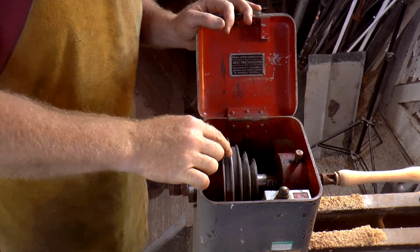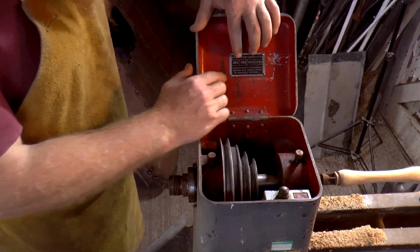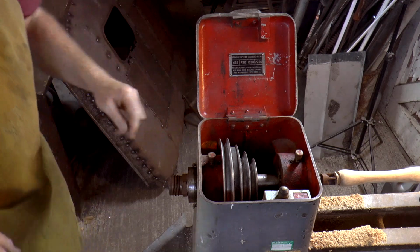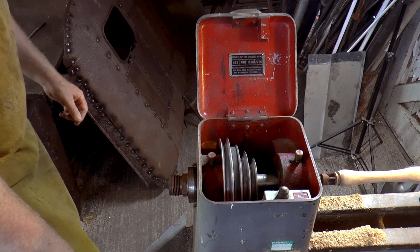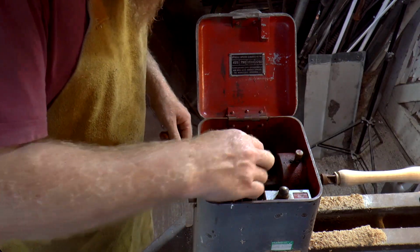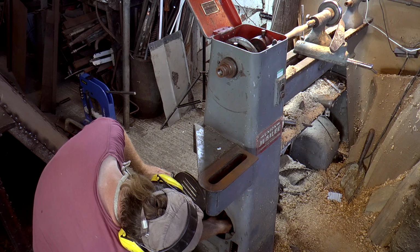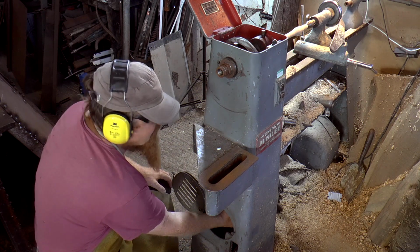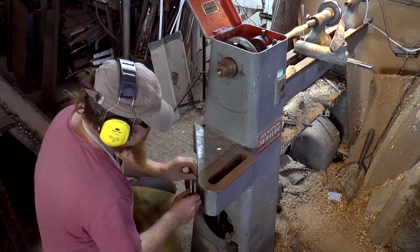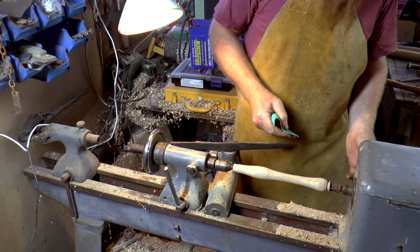And inside the top of the lathe, you can see the pulleys that select the gears. So these are the speeds available, and we've been on the second slowest. I've just slackened off this belt so I can move it over now. I'm going to put it on the fastest one. And then down here is the motor, and it's got the opposite set of pulleys, if you like. And that retensions it. And we are now ready to go. I think it's smooth enough to go straight in at 120.